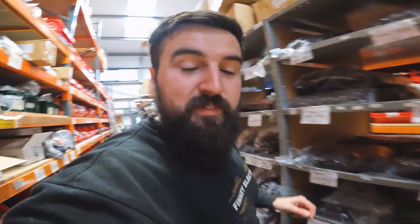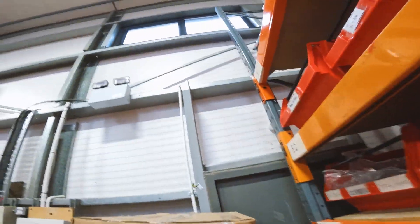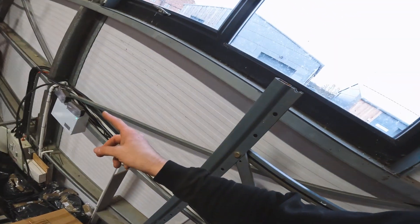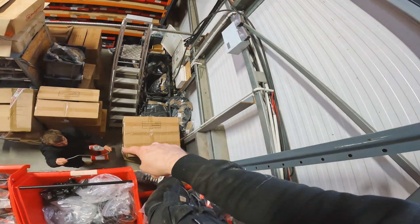If we can squeeze past all these, we'll have to come along, round, down into the fuse board - it's a bit of a tight squeeze as you can see. I've got a little system going, pulling it. There we go, it's to length. I'm going to flip it on that tray now. A bit sweaty work, but we've got it round. We're just going to tie it back now. We've got a data cable as well which will do the CTs. We're running that in now, same route, and then we're just going to tie everything back into this little trough so it should be nice, neat and sweet.